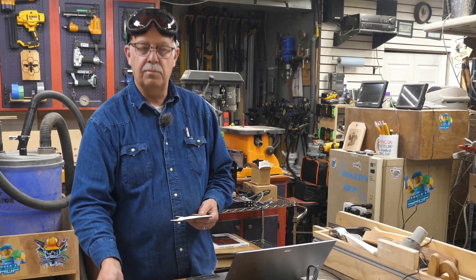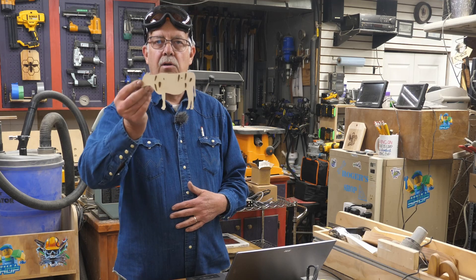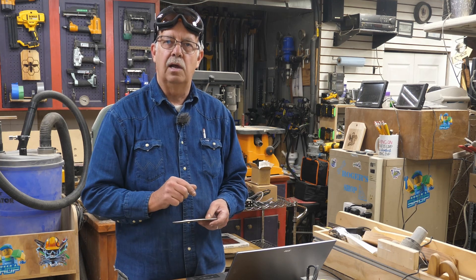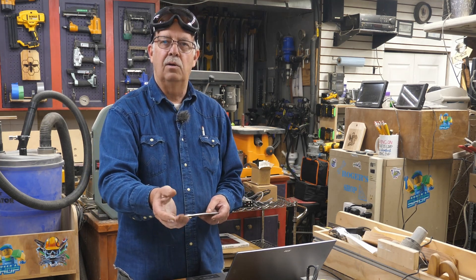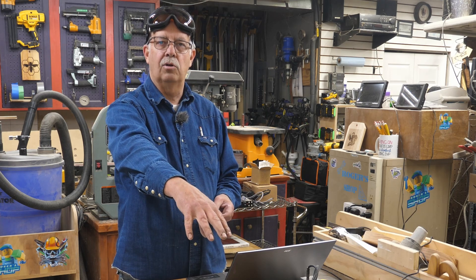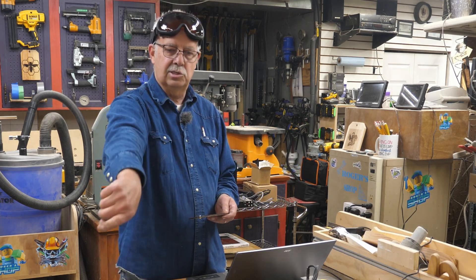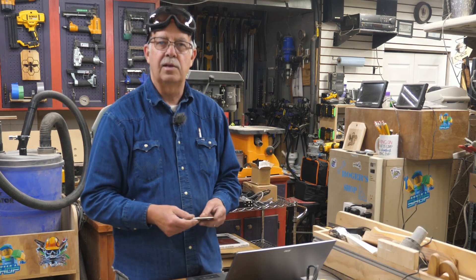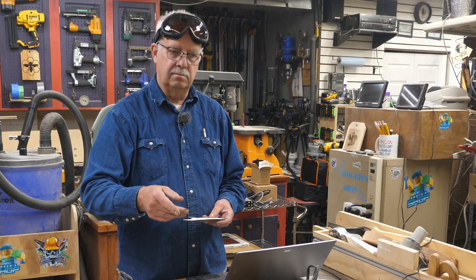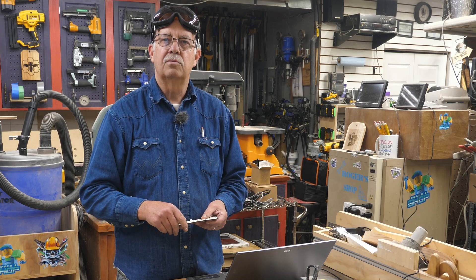Just another use for it, but it's primarily used when you're cutting out wood parts, especially things like cork or leather — it's nice to have that honeycomb board there to keep you from getting scorching on the back. There will be a link in the description on where you can get one of these honeycomb boards. They also have larger ones. I opted for the smaller one because it is the same as my work area on this particular laser, and it's nice and handy. If you have a laser where you're going to need to raise your laser up to use a honeycomb board, there will be a link in the description on the risers for the Laser Master 3. If you have another type of laser, you can send me an email and we'll see if we can fix you up with something.